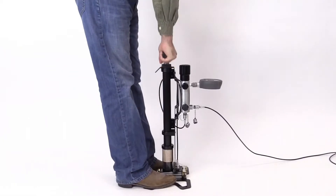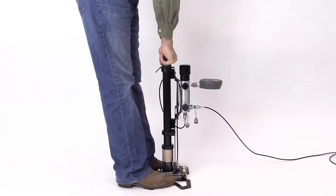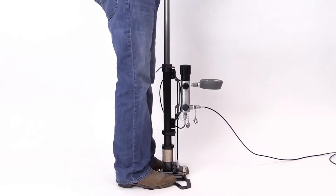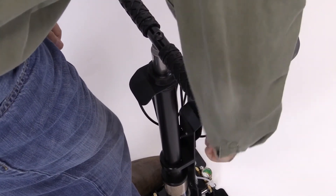Pump the 700 HPPK to generate pressure. Generally, you can generate 21 MPa, or 3000 PSI, within 20 seconds if you pump with full strokes. When the applied pressure gets close to the highest targeted pressure, close the inlet valve. This helps to stabilize the pressure.